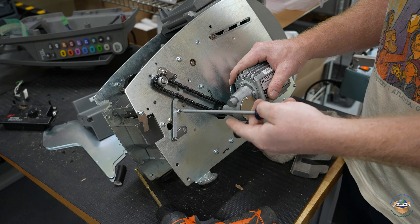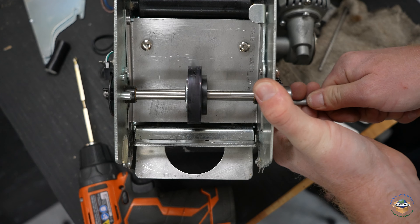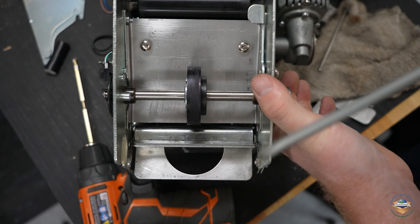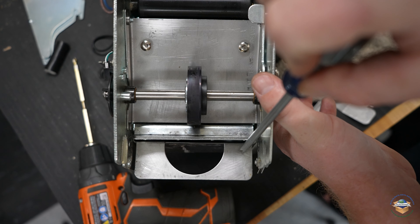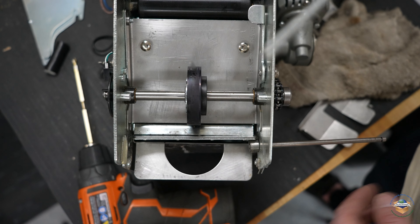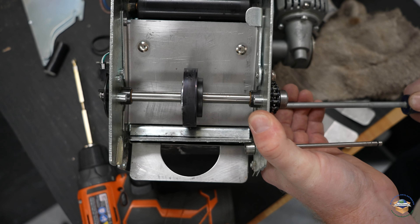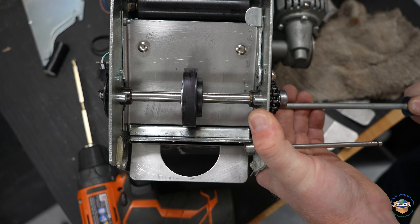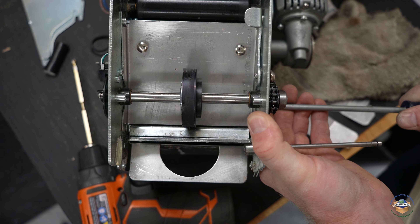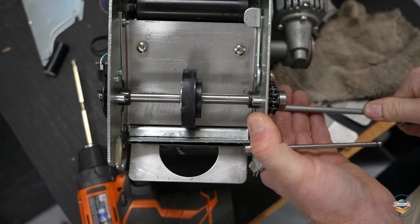There's an adjustment we're going to do at this point. There's a little screw right here — you'll find you can loosen it and then that screw wants to move up and down. When you're moving that screw up and down, you're moving that lower blade. Because I don't have the heater and felt pad in, it rests back like this, but really you want a gap on this side of that lower blade, and this adjustment is where you're going to get that gap. Notice on the left-hand side how that gap appears — I'm making that gap and adjusting it on the right-hand side. Lift that screw up, use your hand under the screwdriver to do it, make sure you've got that gap, and tighten that screw down. I'd do this adjustment with a hand screw so you can make sure that screw is nice and tight.